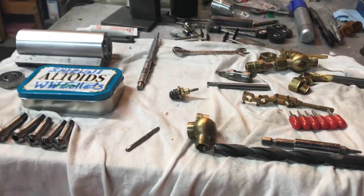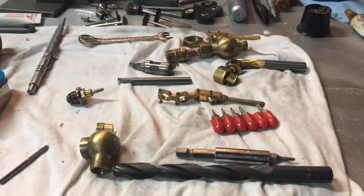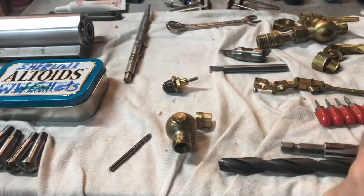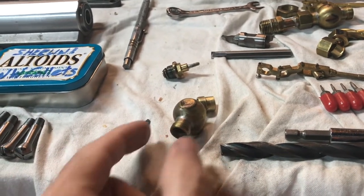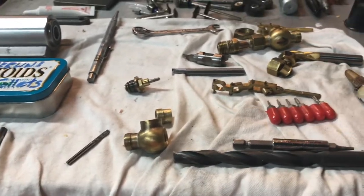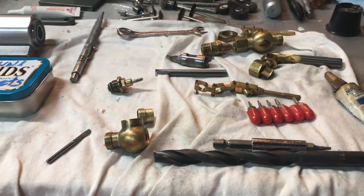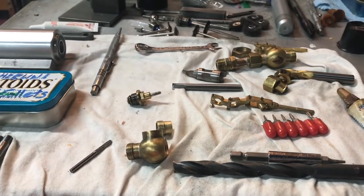It's kind of a long-winded introduction, but instead of showing the new grinding spindle, I'm going to focus this week on repairing the bad ball valve and replacing it with the good one. I think this time I'm going to use some anti-seize on those nuts, because they just hold — it's a compression that holds a little ball into a cone. The threads are not used for sealing; they're just used for bringing the pressure. So having some anti-seize on there would be a really good idea. I'll add this video to my playlist on making the injector start valves.